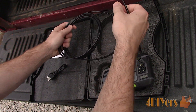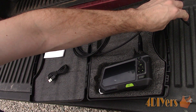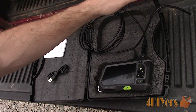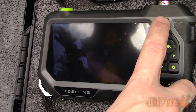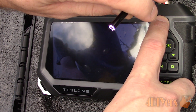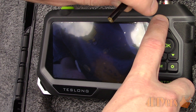The camera has a diameter of 5.5 millimeters or 0.21 inches. Unlike many other bore scopes, this one is equipped with two cameras — one at the front and the other at the side for a perpendicular view, which is great for a variety of tight spaces. These cameras can be toggled by the button on the connector, which I'll show in a moment. Both cameras can be submerged in water and can illuminate with the built-in LEDs, allowing for detailed views in dark spaces.